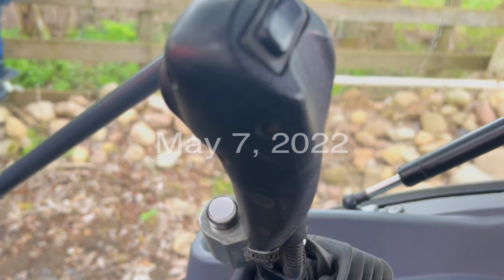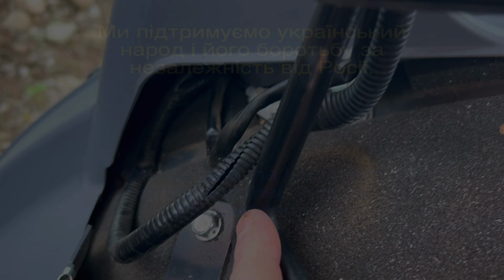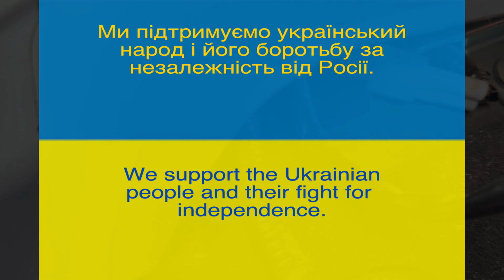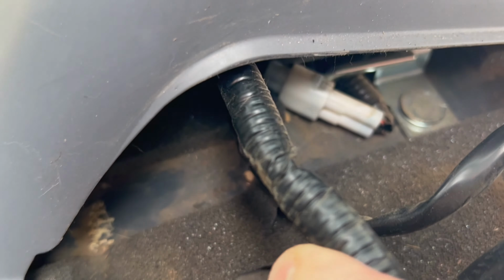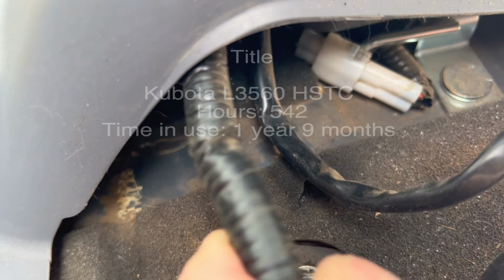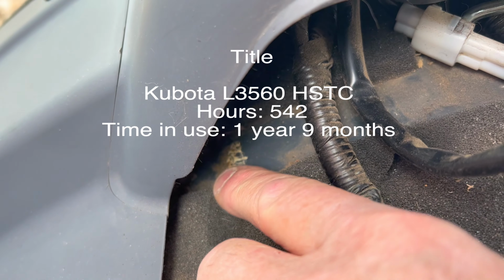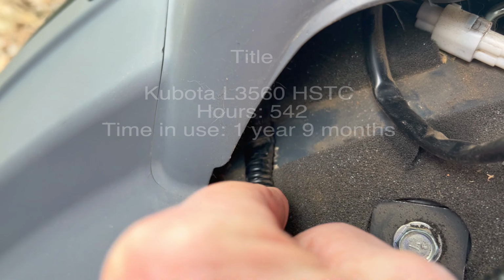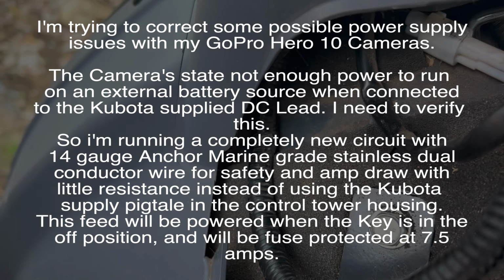One of those things is right here. Look at the wiring that comes from the joystick here and down. You'll see this wear spot, which the housing was actually sitting on and bolted down, so it was basically cutting through the wire here. You can see the wear pattern right here, where it would just vibrate back and forth with the housing on top of it hard. So it was basically like a big pair of scissors.